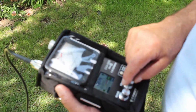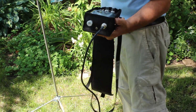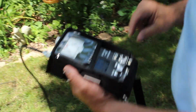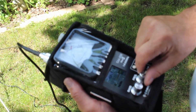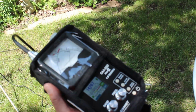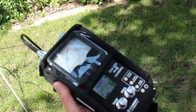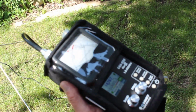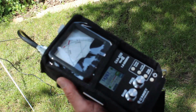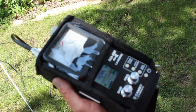There you'll see it actually goes below the ham band, which means that it is actually a little too long. So let's just tune a little bit. Go down 5 or 6 inches, and there we go. There you go. That's the entire 20 meter band, 1.2, 1.3 to 1. So you could hook this up to a radio and transmit on 20 meters without a coil, just the tripod and the whip.